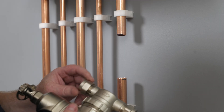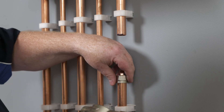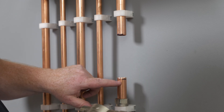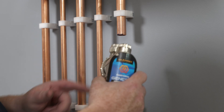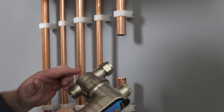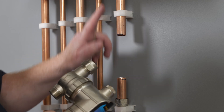Now we're going to install the filter. What I normally do is just take the nut off on the bottom and put that onto the pipework. You could put a bit of jointing compound around this as well if you wanted to. This has got a slip socket on here and it will slip on to the bottom of the boiler or the pipework. It's important to remember that this is the return pipe and the flow of the water is going this way.